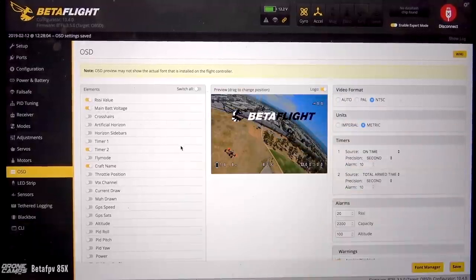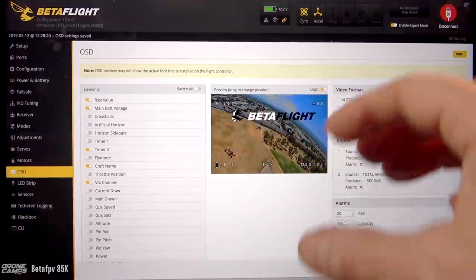And you can turn that on and off as well. You can turn on your VTX channel just by turning on that. Move it to where you want it, top or bottom, wherever you like it. Hit save. And always double check your OSD and everything before you go out and fly for the first time,